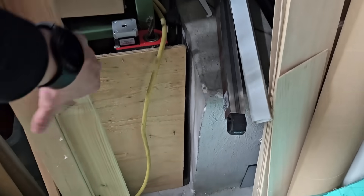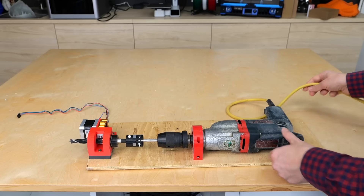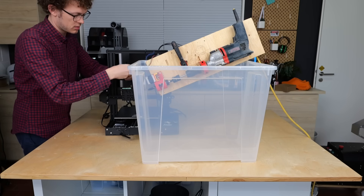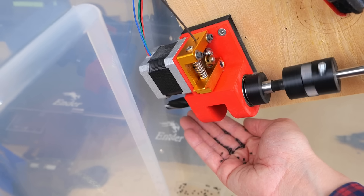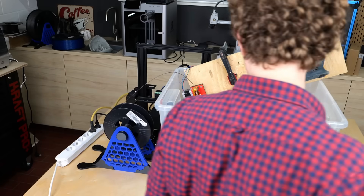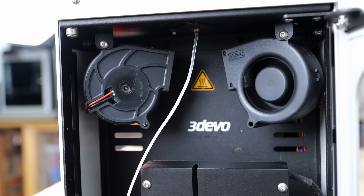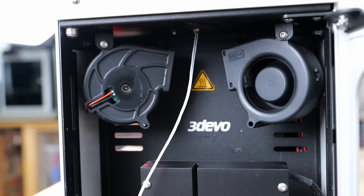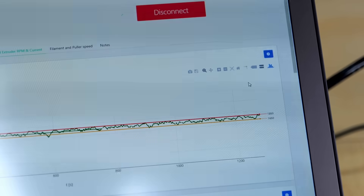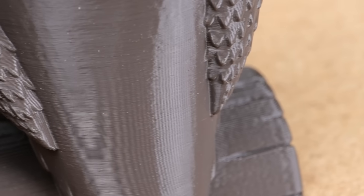That was unsatisfying, but I had an idea to fix it. Years ago I built a filament pelletizer sitting in my basement — a machine that chops filament into small pellets using a drill-powered auger. I connected it to my old Ender-3 running a Duet board with the Mutant toolplate system. The idea was that more regular-shaped pellets would feed more consistently into the extruder, resulting in better filament. I started the extruder a second time, purged out the old material, and fed our DIY pellets. At first, the result looked significantly more consistent with fewer outliers and the initial print results looked better.